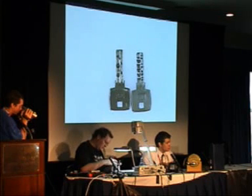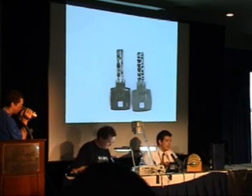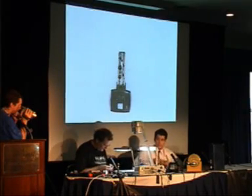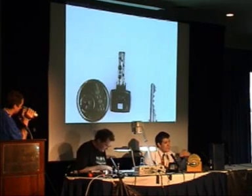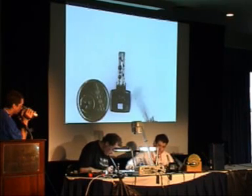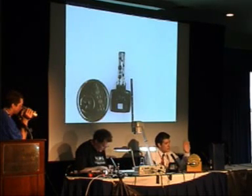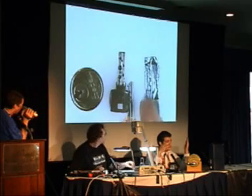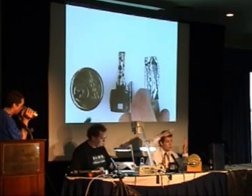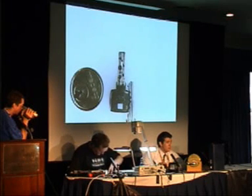Let's go with Medeco first. Medeco is just about the most popular high-security lock in New York City. Medeco locks have normal pins and up-and-down cuts, but if you look closely at the key, the cuts are not straight — they're at angles. On the inside, the pins spin up to about a third, and in the side of each pin there's a slot, so once you spin it, it has to line up with that slot. On the side there are fingers that have to go into the slot for the lock to turn. So you have to get both the up-and-down height and the angles correct — left, right, and center. There's a standard of six cuts, and when you start trying to pick that, you're going to have a heck of trouble.